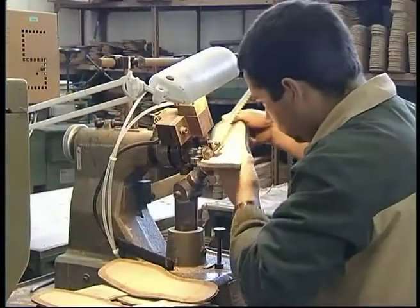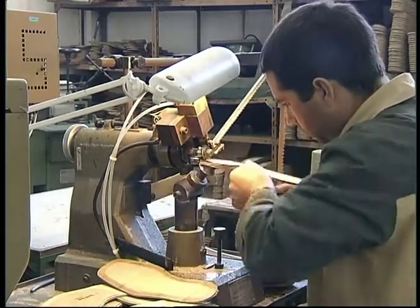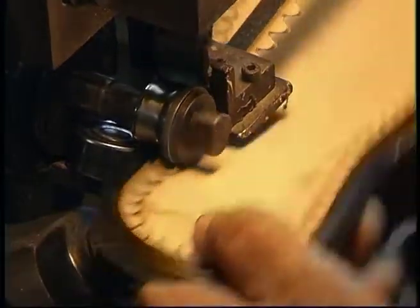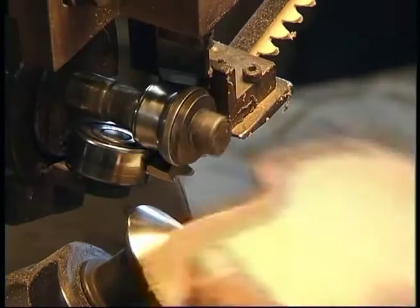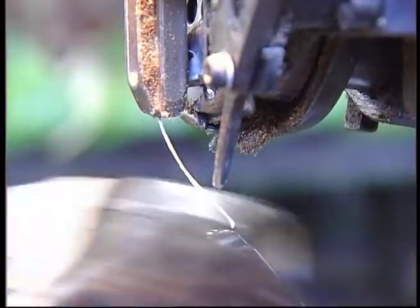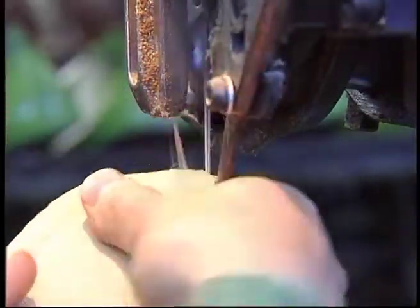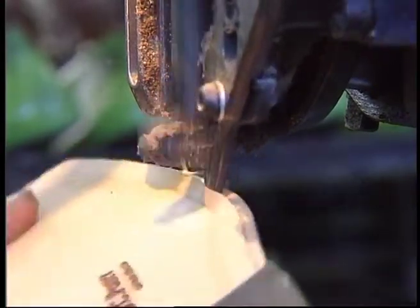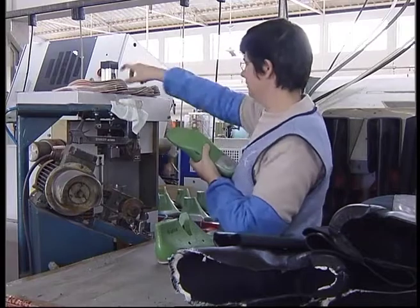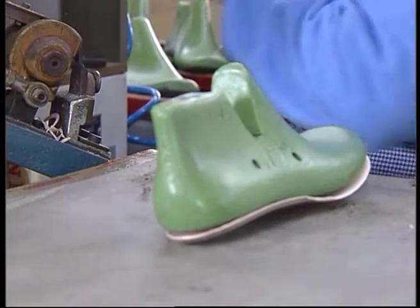To place the welt on the sole. In this phase it is necessary to proceed to the sticking of the welt to the footmark. The welt is inserted in the machine and the employee activates with the foot the drag of the machine, applying the welt to the outline of the footmark. The second phase consists on the fixation of the sole to the upper. To fasten the assembly inner sole to the last: the inner sole is placed on the base of the last and should be correctly proportioned so that it is adjusted to the corner of the last.